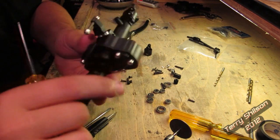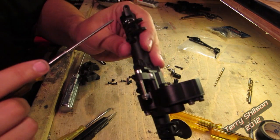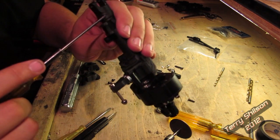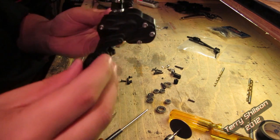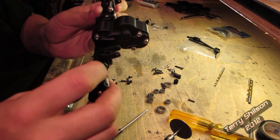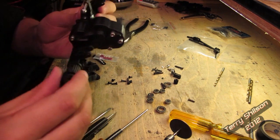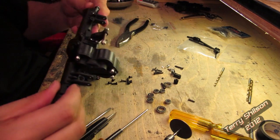Like I said, make sure that it's directional, because now you only want to cut on one side of the hole. You don't want to compromise the strength too much. I ground a little bit there that I didn't intend to. But for this side, I'm going to have to grind the front of the hole again, so they're not swappable now, because the extra spot would be on the back if you swap the sides. So I'm going to go ahead and finish this up.